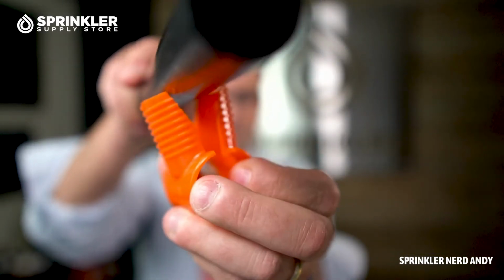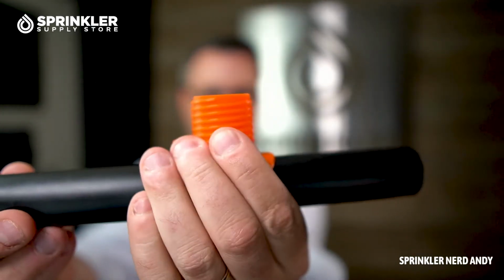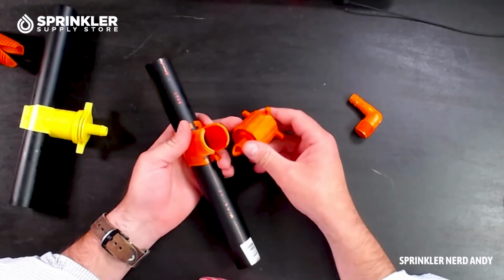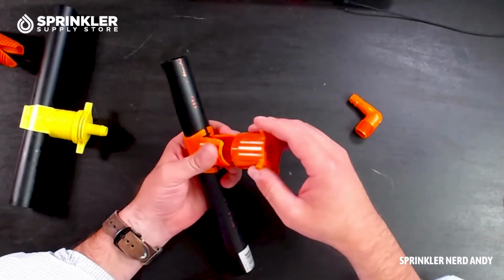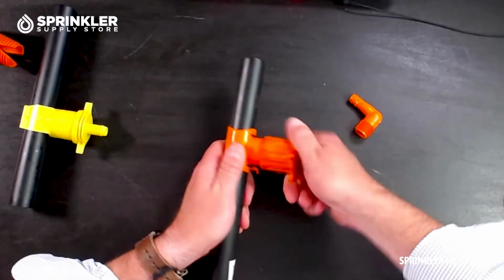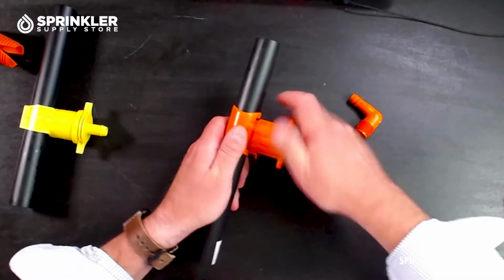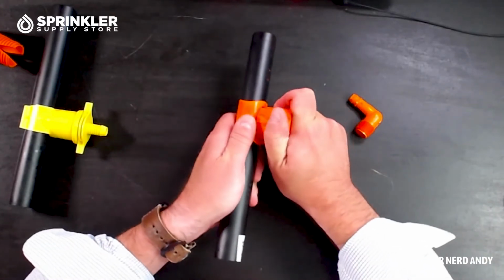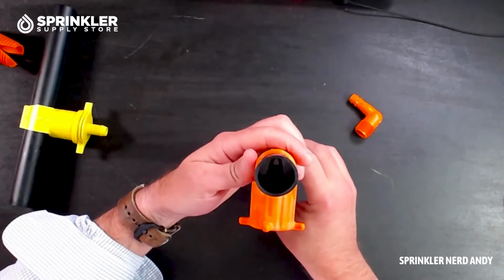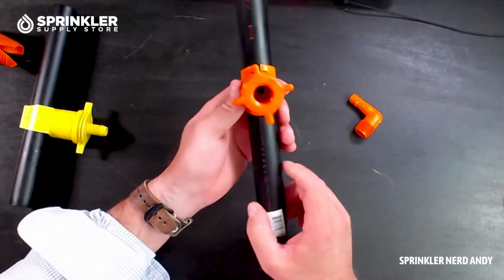There is the saddle. Let's open it up. Drop the pipe in like such. Flip the camera over here. Then we're gonna take the barbed portion of this and we're going to screw it down. Just like Blazing, you gotta keep on tightening it all the way down, and it's piercing through the poly pipe until you can't turn it anymore. Now it is totally locked in, and just like you saw before, there's the barb through the pipe, it's punctured.